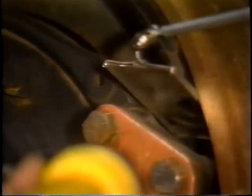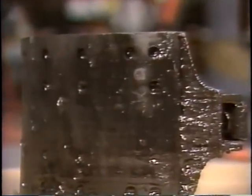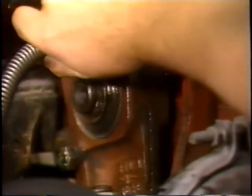Also, remove any grease from the cam head, rollers, and replace the linings. Grease on the linings can cause poor brake performance. And finally, make sure you lube the slack adjuster.